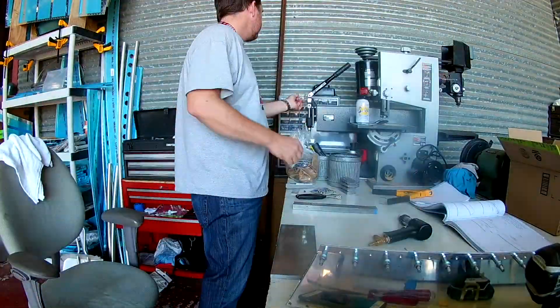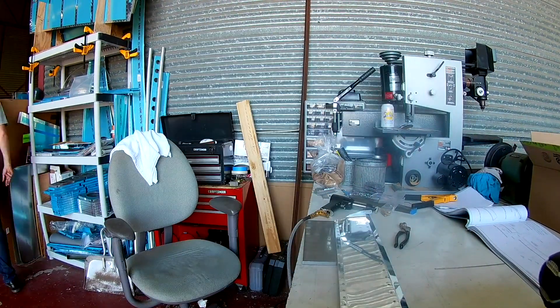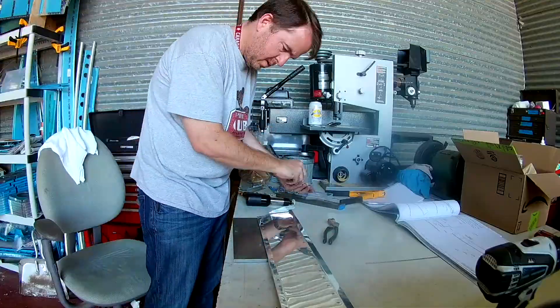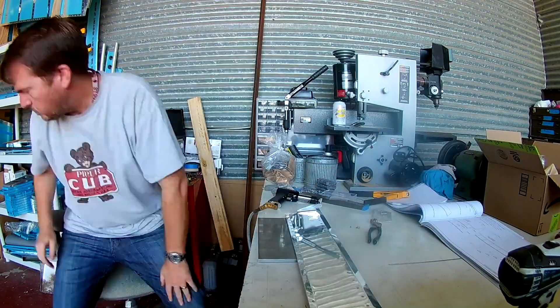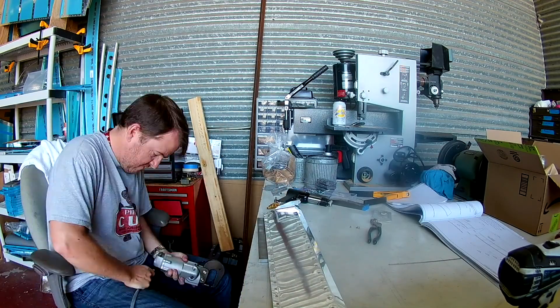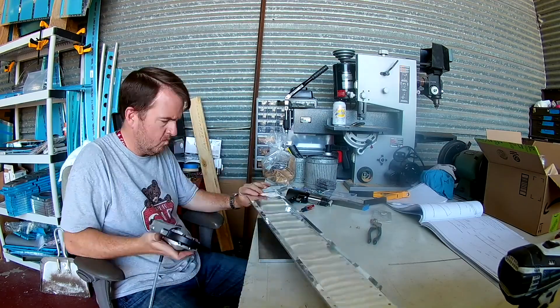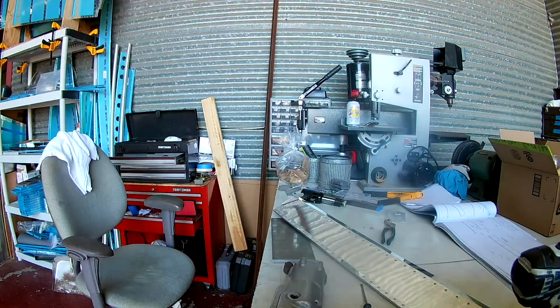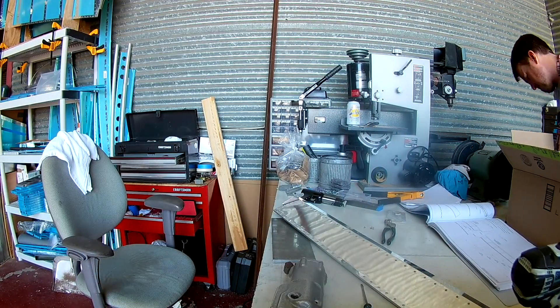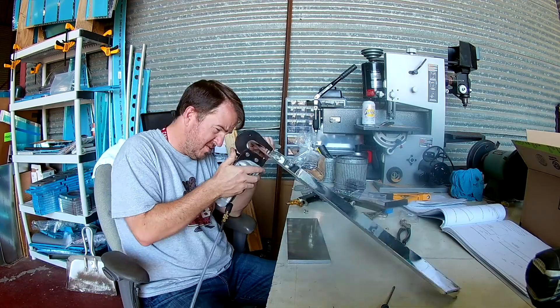It does call for back riveting, but for a number of reasons it just didn't quite work out. You can see me giving it a try here, but basically because of the difference in the angle - on the rudder the trailing edge came to a spike, a little wedge. On the elevators and trim tab it is not a wedge; it actually gets thicker at the back. So shimming that so it is perfectly flush and resting on a flat table just didn't work out - the trick just wasn't happy.